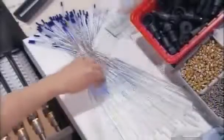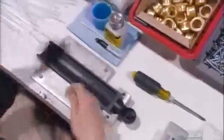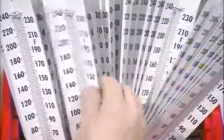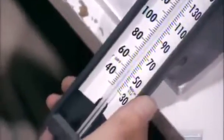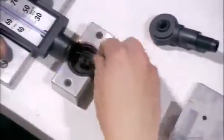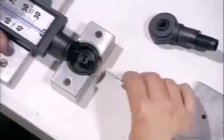They install the top section of the thermometer in a case, which can be metal or plastic. They then choose the appropriate scale and slide it between the glass tubing and case. They wrap part of the wire capillary around a joint and then cap it.